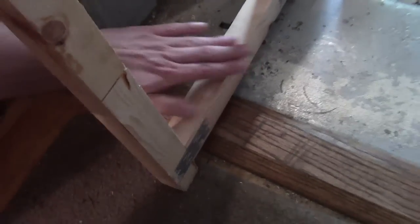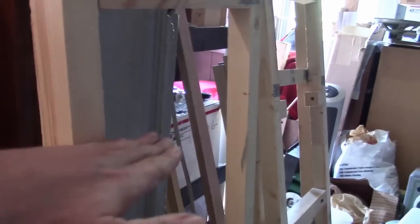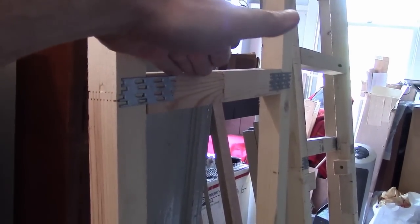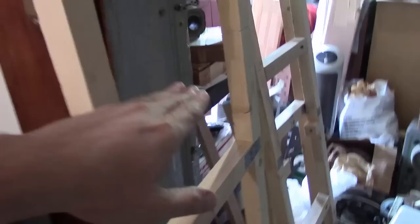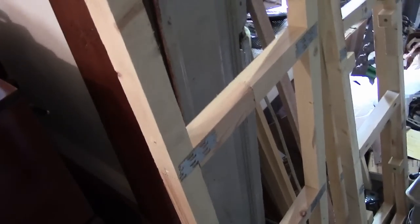So I decided to take a step back, get a couple fresh ones, and not do any cutting. Just leave them exactly as they are and stick with the concept of putting in little stubs to support more shelves between the existing ones. Measuring 10 inches up each time, I can get 7 shelves total. If this works out I may make a second one or add an extension, but I want to get something going quickly. For the cross pieces I'll use some 1x2s to bridge the gap.